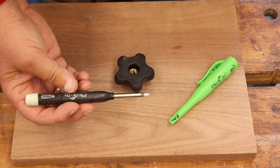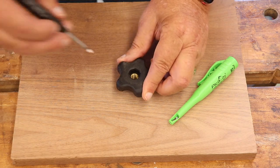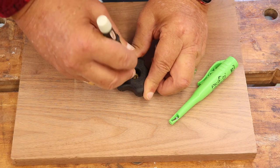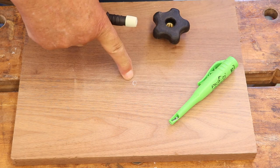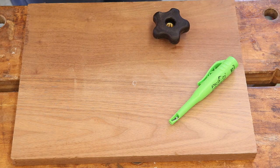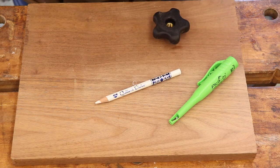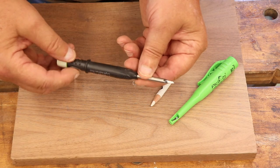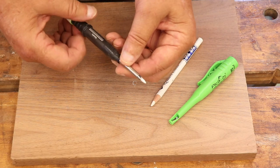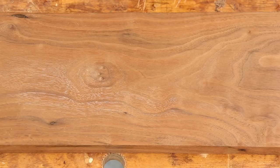These pencils are called deep hole pencils and they're used a lot by carpenters. They're designed so you can get down into a hole and scribe inside a circle to get the outline inside a knob or similar piece. What I'm finding in the shop is that the quilter's choice pencils needed constant sharpening and the point would break off fairly easily. This Pika is much sturdier as far as the point is concerned, and much easier to sharpen — I'm not using nearly as much lead to do that.